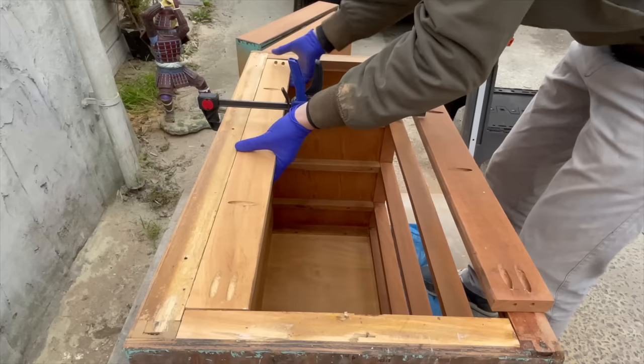And now you can see that the bottom drawer will not close because the bottom stretcher is twisted and bowed. So I decided to fix it with a piece of oak, some screws and glue. I wiped off the glue that squeezed out and I used a hand plane to make it flush with the stretcher. And then I used my hardware jig to attach the handles.